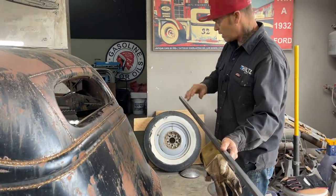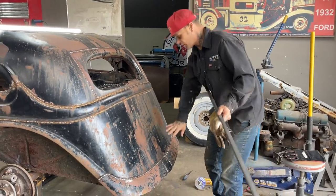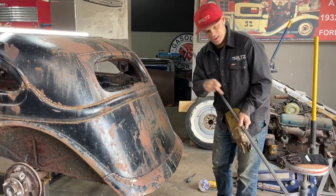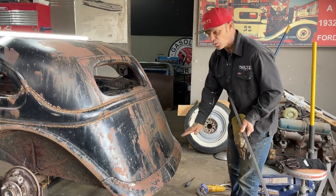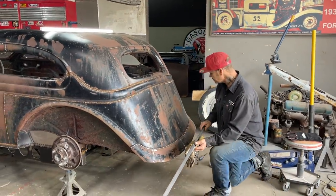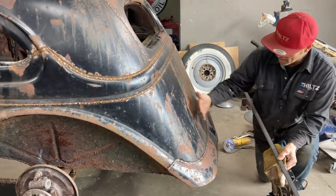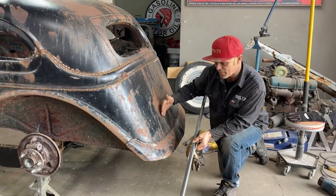What I'm going to do is weld this here to the square stock. It's in there. I'm not going to try to make it fit the back. I'm just going to run it straight across. So there's going to be a gap there where this is still not tied in to the floor. The whole outside of the body has to be tied into the floor. It doesn't have to be, but it's supposed to be, and it should be. But what I'm going to do is cut it off to length, put my square stock in from there to there, and there's going to be a gap in the back because there just is, because I'm only coming back to the wheel well here somewhere.